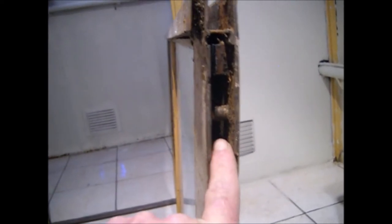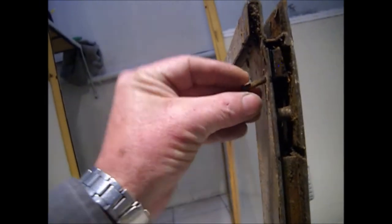Apparently, the issue was that the original wheels of this door either broke or were destroyed by rust after years of use. So the door didn't roll. It was stuck on the rail. So when the cowboy installer put a bolt there, he didn't stop the damage to the rails. Therefore, what we're going to do here to begin with is remove this bolt.